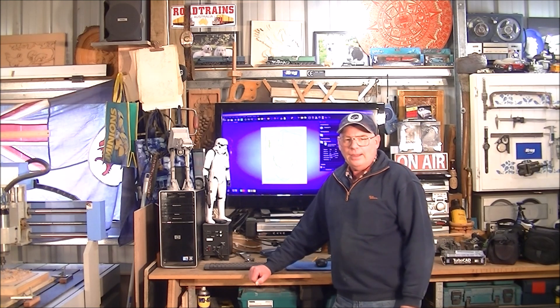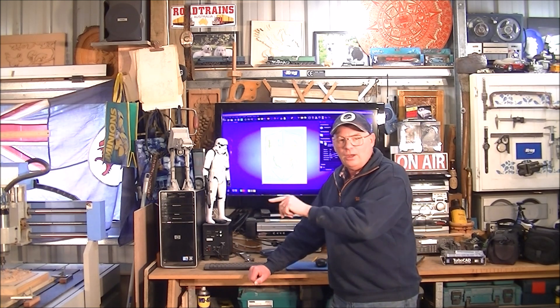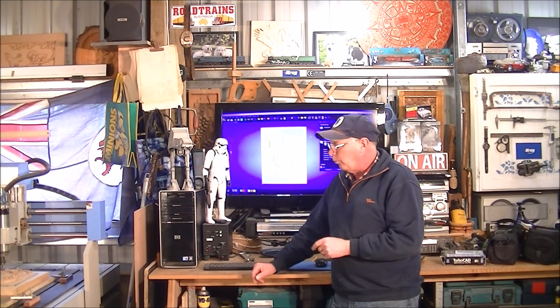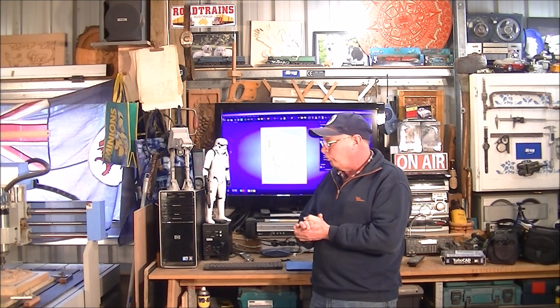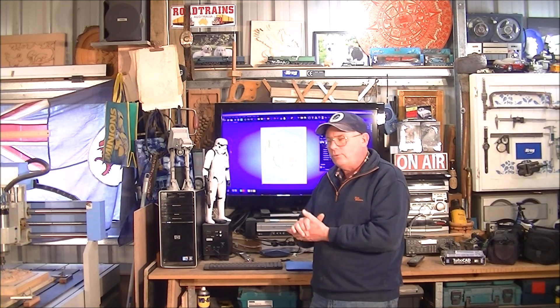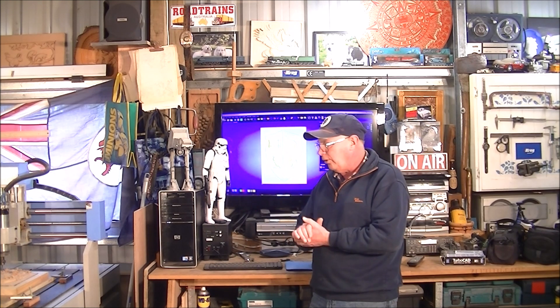Hello and welcome back. In this video, we are going to cut this with Gwen, my CNC router. First of all, we are going to do a roughing cut with a 6mm ball mill. Then we are going to do a finishing cut with a 3mm ball mill, and we will see what sort of job it turns out. If it is not quite crisp enough, we will put a 1.5mm ball mill through the same job to bring the clarity up.